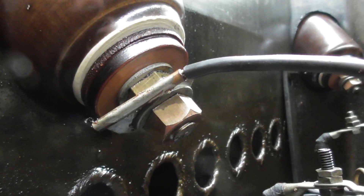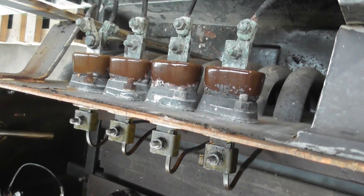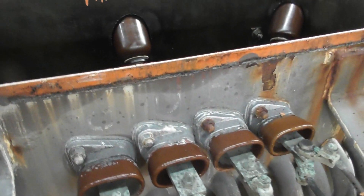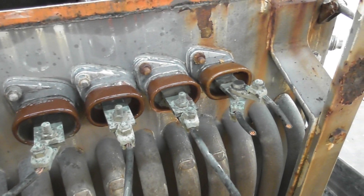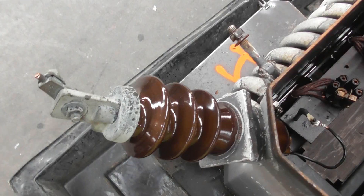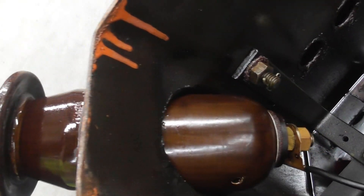But yes, oil has definitely leaked out of this thing. New bushings — LV bushings. The C, B, A neutral. Normally from the neutral, an earth wire goes to the tank to maintain your MEN system. The bushing goes through the steel here into the tank.